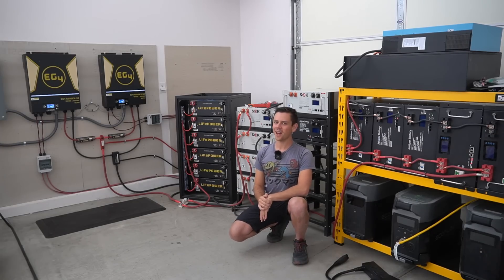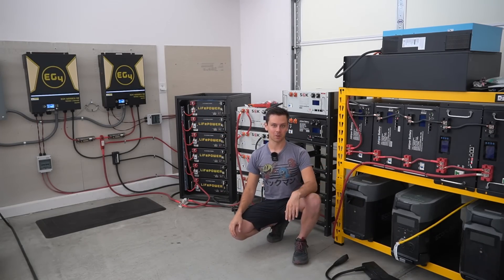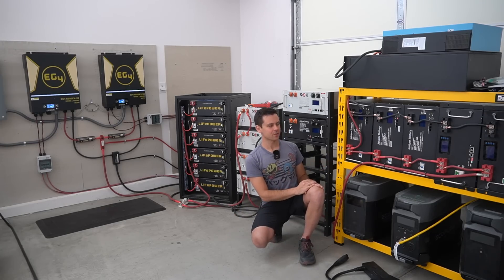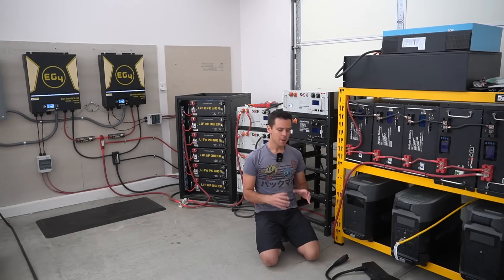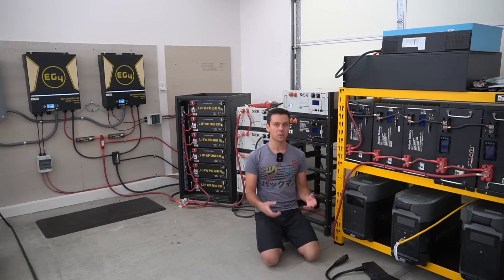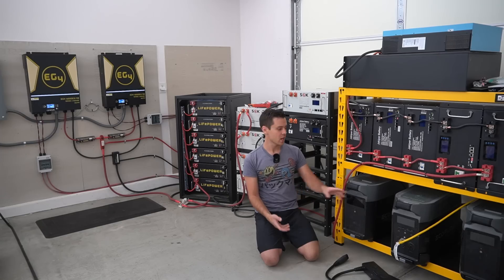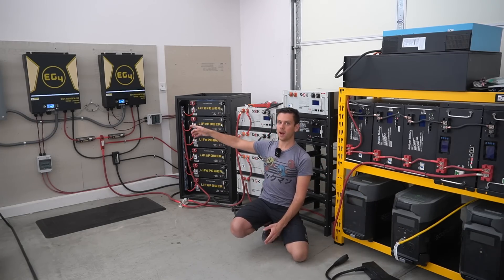The big question people have is: should you build a DIY system or simply buy an EcoFlow Delta Pro? If you have the money and stack them, it is a good system and I really like it. But if you want an autonomous system that turns itself back on again, the EcoFlow Delta Pro is not for you. If you have a cabin in the middle of nowhere with a SIM card router and need power 24/7 — and if power shuts down you need it to turn back on once it recharges — these will not work. You will have to build a DIY solar power system.